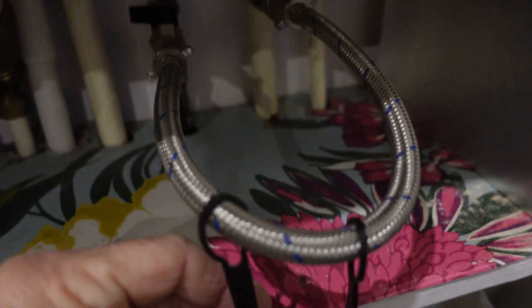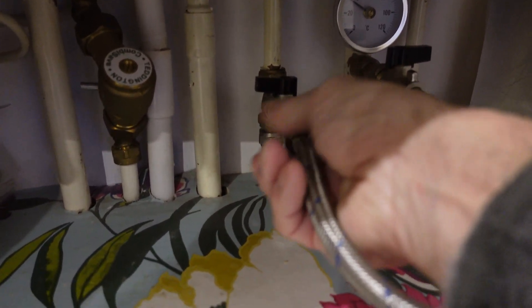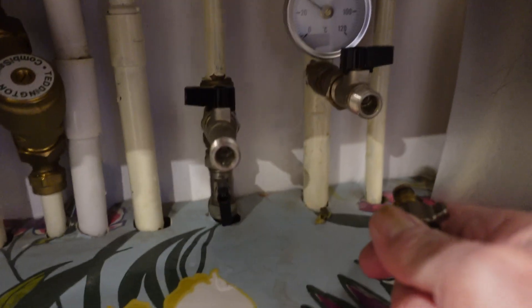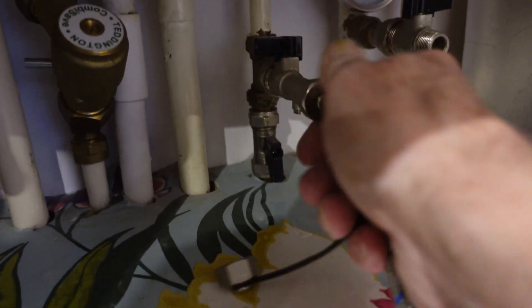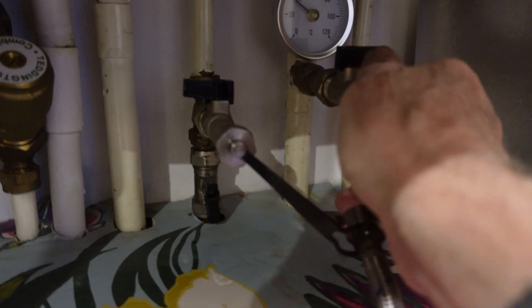Really it's the wrong thing to do. We should have the caps on — they're dead easy to fit. You just unscrew these off the end here; they shouldn't be too tight, you may just need grips. Take this off and your filling loop can no longer fill the boiler — it's disconnected. On mine there are two caps, one here and one here, which go on to cut these off. Put the caps on — you can leave the filling hose connected like that in the cupboard, but that's how it should be.